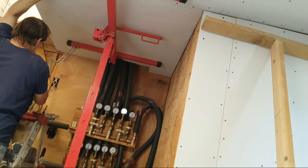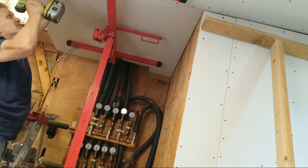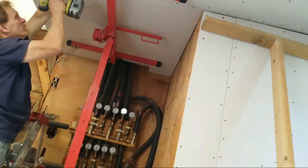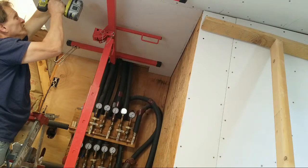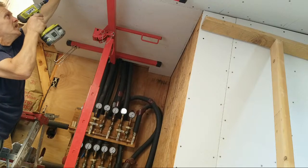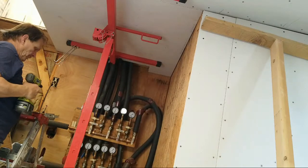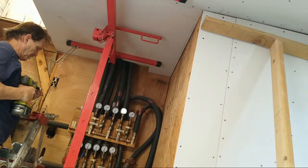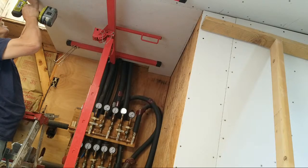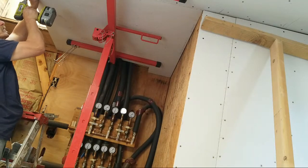They do have these professional dimplers that have about 8-10 screws that you have on a plastic belt, and it automatically feeds them as you go, and that makes it really nice. Now I'm coming away from the edge about 3/4 or so.